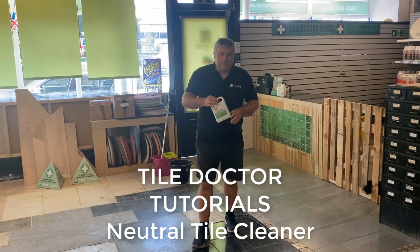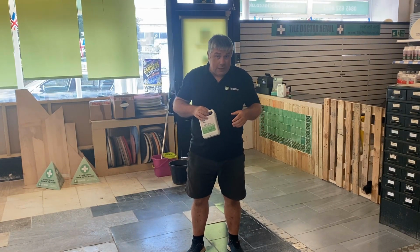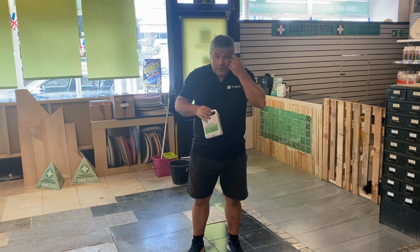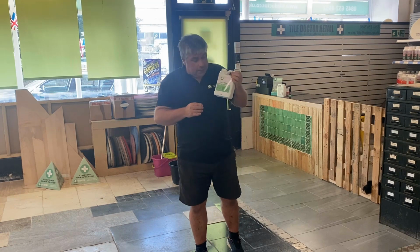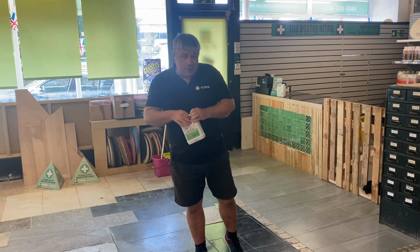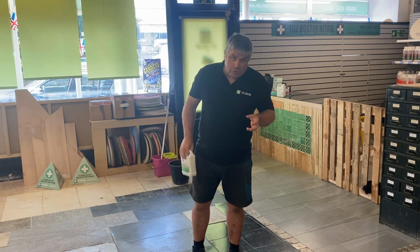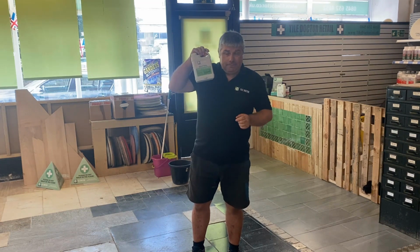Hi, we often get asked how to clean ceramic tiles, porcelain tiles, stone tiles, any type of stone, terracotta, marble, all that type of thing. And we always say the same thing to people: use a pH neutral cleaner. It's got to be a pH neutral cleaner. If you've got a stone tile, if it's been sealed, all stone tiles are sealed, so you've got to use a pH neutral cleaner. This one's called Neutral Tile Cleaner.